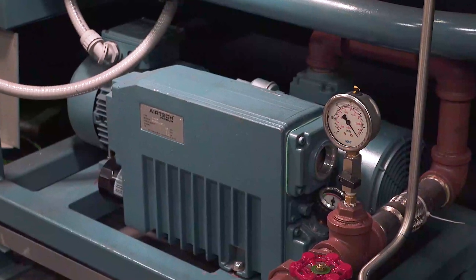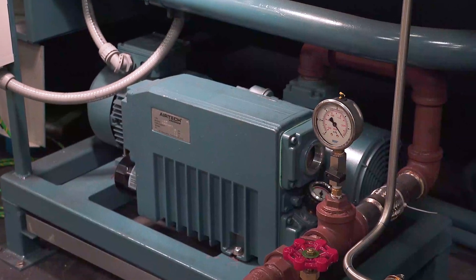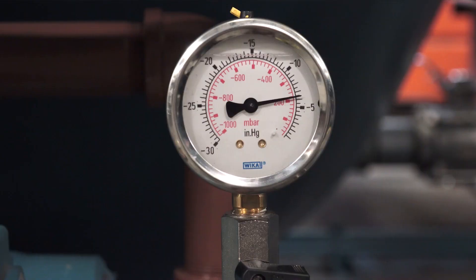Although there are different types of vacuum pumps, ASC mostly uses single stage, oil flooded rotary vane vacuum pumps. This type of vacuum pump provides vacuum levels down to 1 micron at sea level and are relatively inexpensive to maintain.